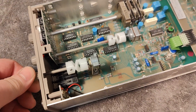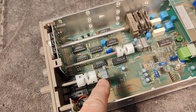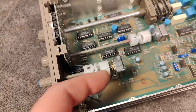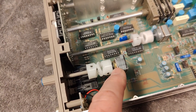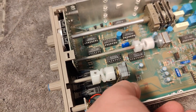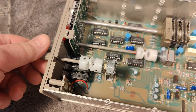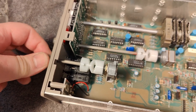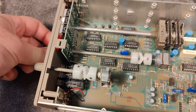There is another little thing — I think this is one of the reasons why they broke to begin with. The lubrication on the potentiometer shafts inside the potentiometer — that kind of oil turns itself into chewing gum over some years. So if you give this a tiny little drop of Contact 61 or something like that, it goes in there and — see — I can just grab this real easy and now they move super, super smooth.